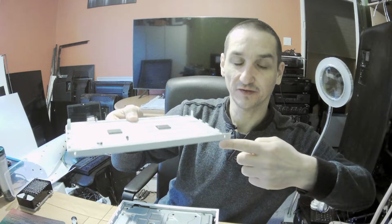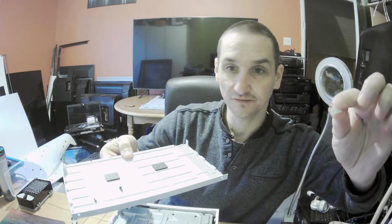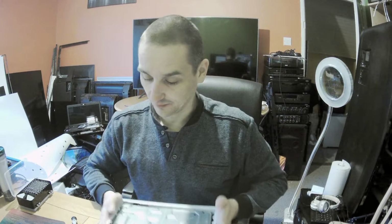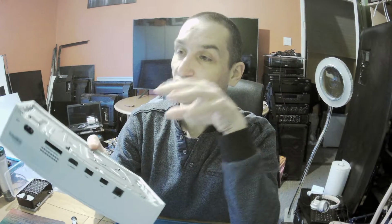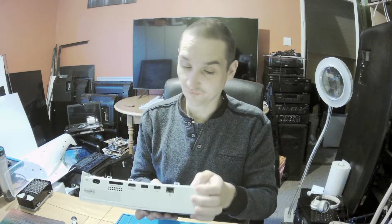Okay, just a quick intro for those who don't know. So this needs to go out first. You have two screws on the sides behind those thingies, and then you can take it out, and then you've got these screws. The green ones in all the Xboxes are the long screws, and you need to take them out before taking this one from this plastic. Then once you've got those green ones, you can take the rest.